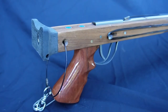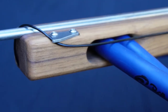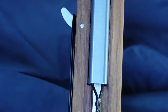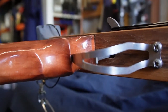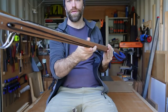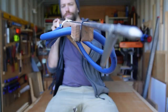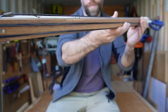Other than the major blunder with the router, there were no other mistakes I was able to identify or that needed repairing. I was quite happy with the way the inlays came out, and extremely happy with the accuracy of that trigger pocket and the shaft track, which are the most crucial aspects of this build to ensure that everything actually shoots straight and releases properly. The teak itself is expensive but I think well worth it because of its natural oil qualities and buoyancy — you can buy cheaper timber but the value of the teak is worth it in this final result.